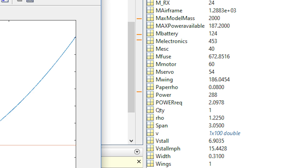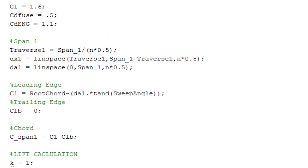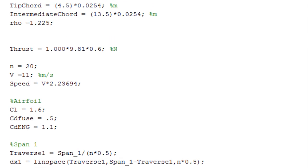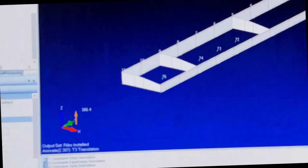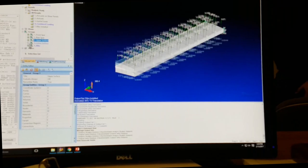Because the analysis sounded good, I ended up coming back to things and digging into it a little deeper. From there, I ended up revising the code, adding a lot of extra equations. I was able to figure out all the different features on the wing itself, like the lift over the wing span. This feeds into more intensive calculations down the road for structural analysis, where now I know the lift at each part and I can optimize the wing based on how much work it's doing to actually hold the aircraft in the air. So over a variety of speeds, I can figure things out, and at the maximum speed and at the maximum pull angle, if I'm pulling out of a dive,